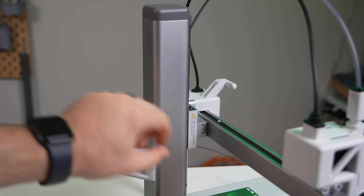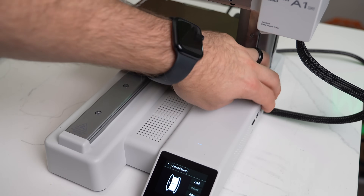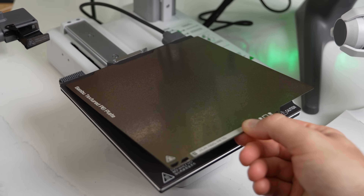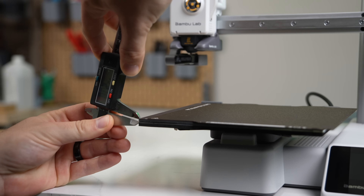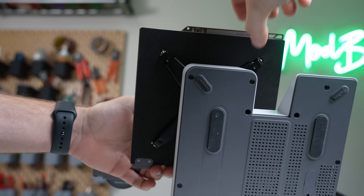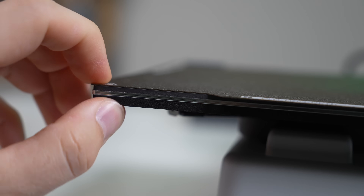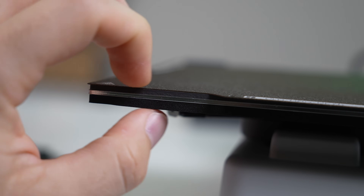The main structural pieces of the frame are made of aluminum, with lots of injection molding used to cover the base and other electronics. The print surface is a magnetic, powder-coated PEI flex plate system. The bed itself is quite thin at around 2mm, but it is rigid-mounted to a steel bracket on the underside which helps to reinforce it. There's also 3mm of insulation on the bottom to help with heating up and keeping the heat from escaping.